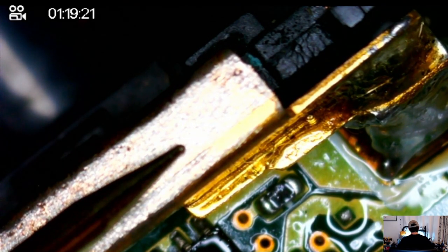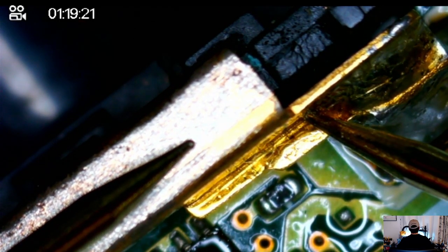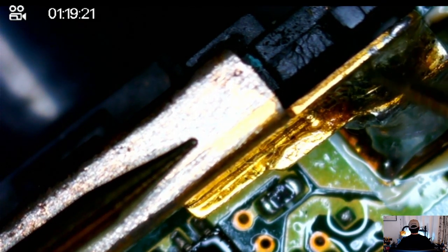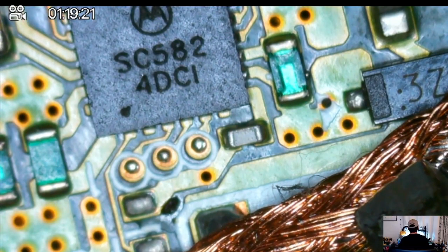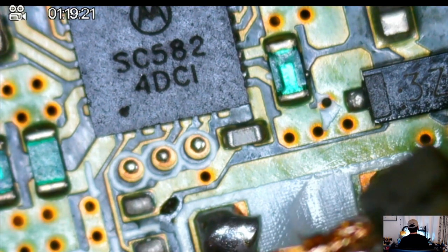Here I'm making sure the connection still works — using a multimeter in continuity mode to make sure it's beeping all along and that there's a solid connection from the top over to where it touches the main board. Then to clean up the flux that was used — the flux I'm using loves to leave these sort of brown burnt marks, which not all solder does.